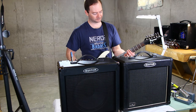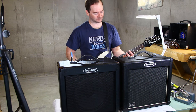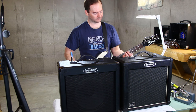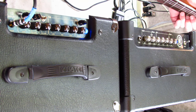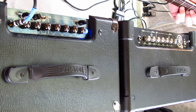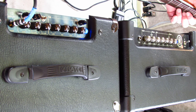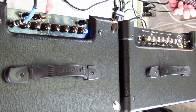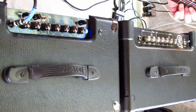I've selected. So this thing, we'll go over in a little bit. Got two output tubes in a push-pull configuration, and one dual triode. I'm not sure how I have it selected, but we'll look. Oh, okay. I think I connected it so it has a switch between the clean and the overdrive channel. So I think we've got the overdrive part driving the triodes when it's selected to the overdrive. Otherwise, it's just straight in.